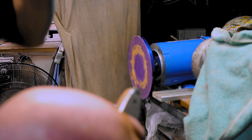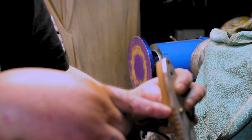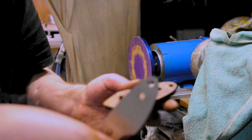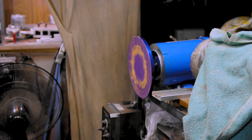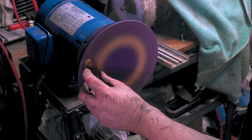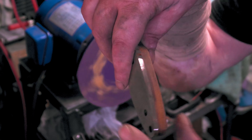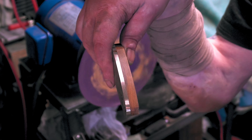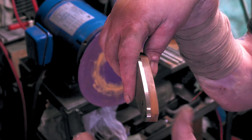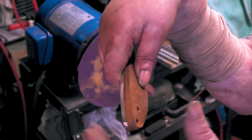If you look, there's a gap right here, which means some of this back needs to come off and maybe some of this front. So I'm going to take it off, get this pin out, and flatten it. And just like that, we're even. That's why it's good to use pivots — if you pin everything on there and you think the clamp will pull it in and it doesn't, then you're screwed. With pivots you can always take it off, fix it, and do all that.